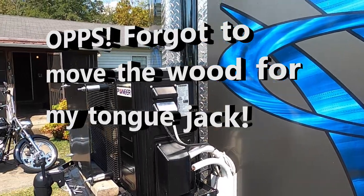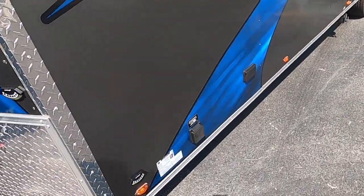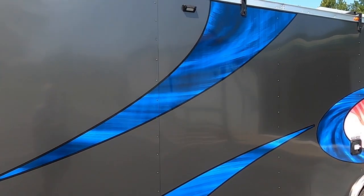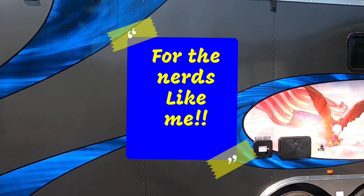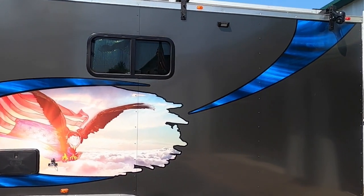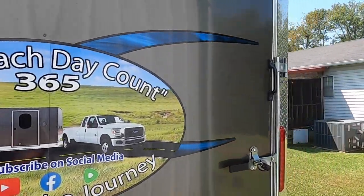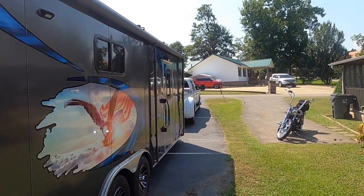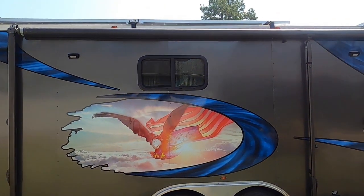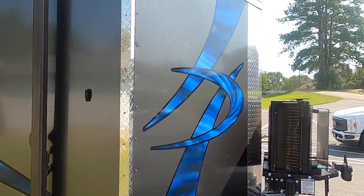The trailer is sitting here today with the mini-split running and it's 75 degrees inside. I have not hooked up to shore power — I never do when I've got solar working. I have enough power that it can run for about two days. I've got a 24-volt system running a 3000-watt pure sine wave inverter, four 24-volt 300 amp-hour lithium batteries, and on the roof I have 2225 watts of solar panels — that's two and a quarter kilowatts sitting on top of the trailer. I don't have any problem powering anything — the fridge is running, the lights are on, and the mini-split is running.